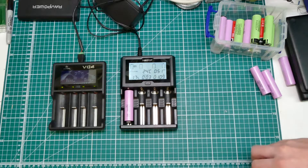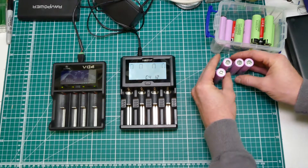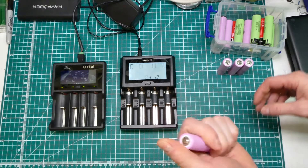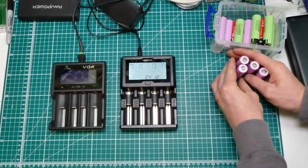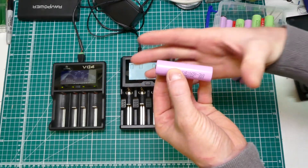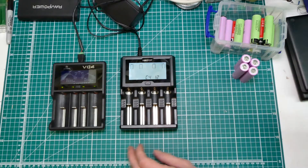It's finishing cells at 4.20, no issues at all there. People get really anal about that termination voltage - it's not that critical honestly. I've been in discussions with people worried about it going to 4.21. So 4.20 - that makes no difference, and if it finishes the cells at 4.18, 4.16, or 4.15, even that's still fine honestly. The higher termination voltage the less life you'll get out of them but it won't affect it to any noticeable amount at those levels. And bear in mind when you remove one of these cells the 4.2 volts applied to it is then removed - the voltage from the cell must be lower because if it weren't it would be discharging - and it will drop those a couple of millivolts. Nothing to worry about at all.